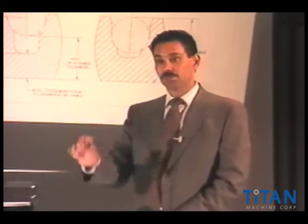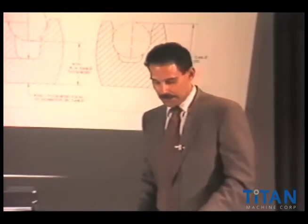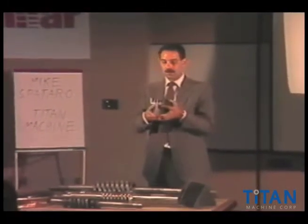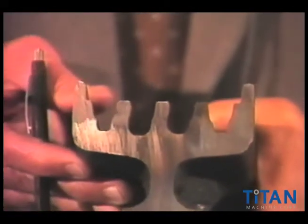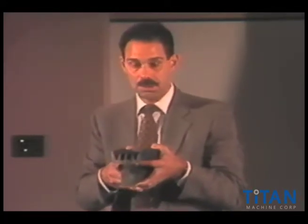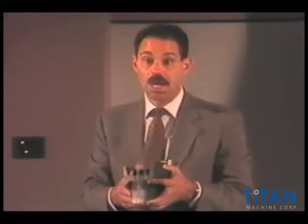If we're running half-inch cable, when we're finished re-grooving, we need at least a half-inch of material in that area. We have here a sample — a section of a drive sheave that came in and we were told to re-groove it. Notice the two center cables are bottomed down and the two outside cables are not. Had all of these cables been the same height, then a re-grooving could have been attempted — a very short, stubby groove is not uncommon. But in this particular case, this is not a re-groovable sheave. It also demonstrates how a sheave is made — notice the actual draft or taper.